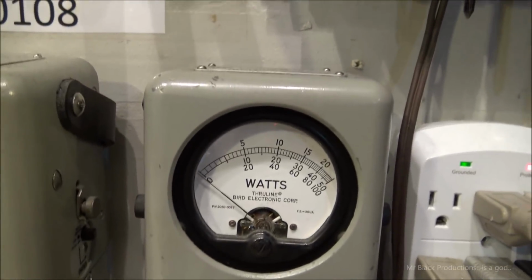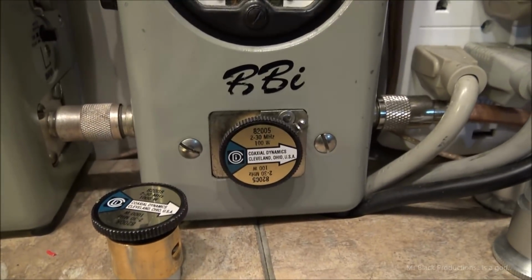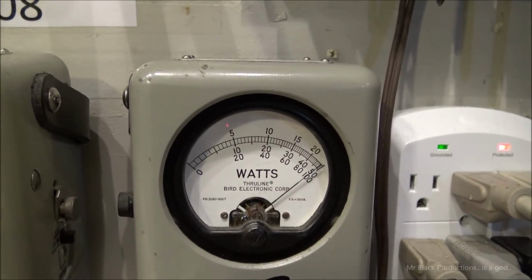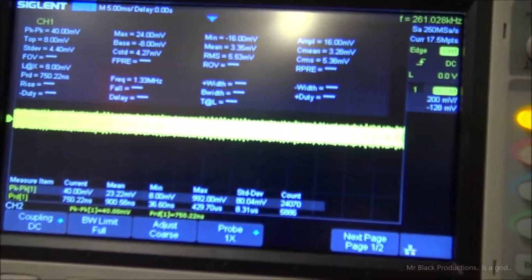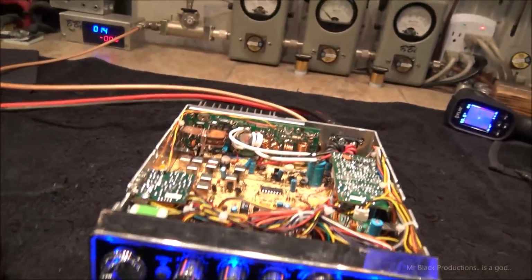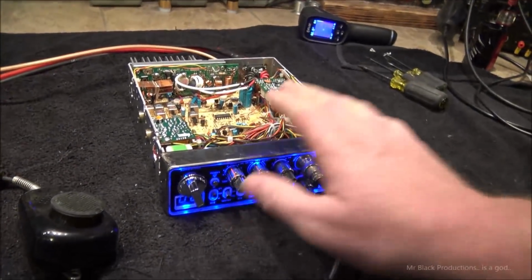So on the bench power supply, from about a 2-watt dead key, that's a 100-watt slug in 2X, by the way. Very solid 200 watts. Not pinched in the reverse or negatives or none of that other stuff. That, and I got a mic gain knob. I know how to use it. And all the limiters are still in this radio, just like they were in the other ones. So I think this is the one I'm going to end up keeping.